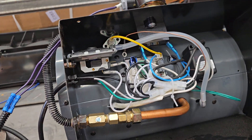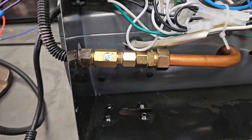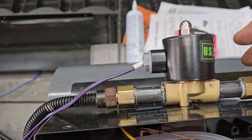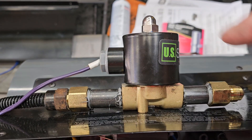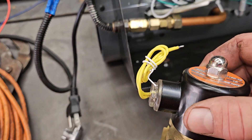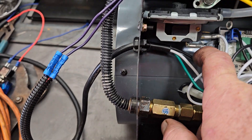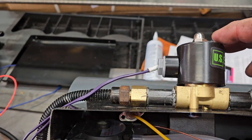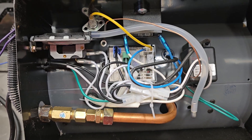You've got to make sure that your heater has an automatic igniter — you must have an automatic igniter in order to modify it this way. So you've got your gas line, you've connected it together, it comes around here. The easiest way for me to mount this was outside. Now this is my DC solenoid — I've got to swap it out with the AC when I get it, but you just pipe it in. The wires on the 110 AC solenoid — notice there are yellow wires — these two wires connect into your line and your common, your black and white, as it comes in from the plug. Connect them directly to that. So when you plug it in, that'll open your gas valve, turn the gas on, the whole heater goes to work to ignite the gas, and you've got heat until you unplug it.